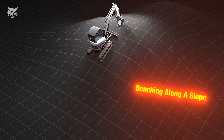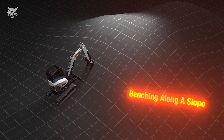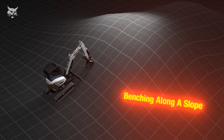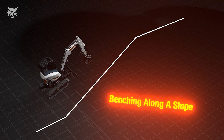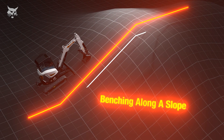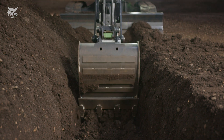For example, let's imagine the excavator is repositioned downhill to where the machine is now sitting 3 inches lower than it previously was. If we skip establishing a new benchmark, our grade point will be 3 inches lower than what we previously excavated. After establishing a new benchmark, another digging cycle can begin.